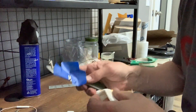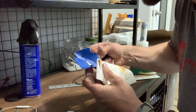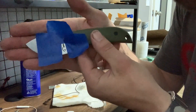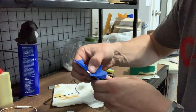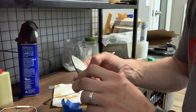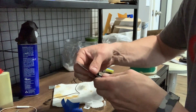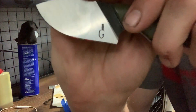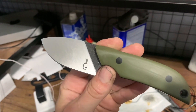Just take a paper towel and wipe it and look at it — it's pretty good. I always take a little bit of oil because if you don't oil this spot it will rust a little bit. So rub it with oil with your finger, then peel your tape off and your stencil, and see what you got. There you go — your logo's on there and it's pretty even.